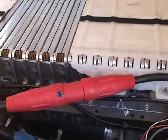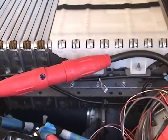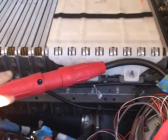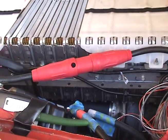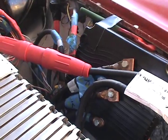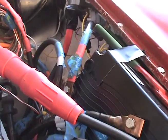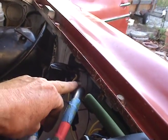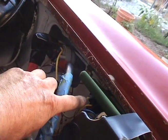This is a large disconnect, which is of marginal use. It would disconnect the 400 volts, but it wouldn't disconnect the 100 volts when we have it in 100-volt mode — we need to fix that. This is a Curtis 1238 controller, three-phase AC, with 100 volts input through a contactor over there.